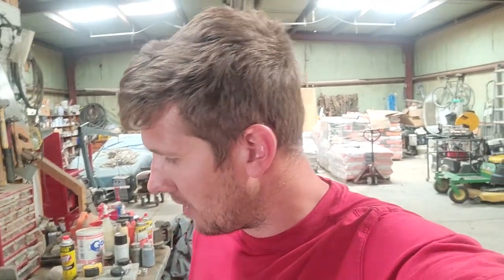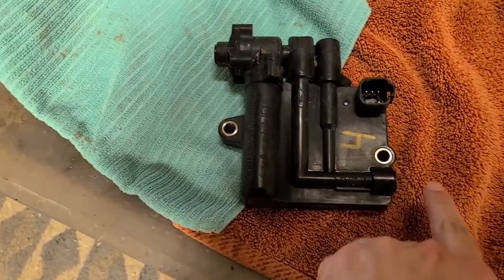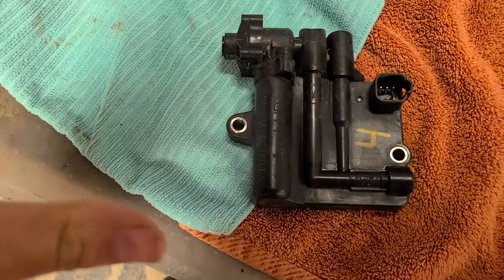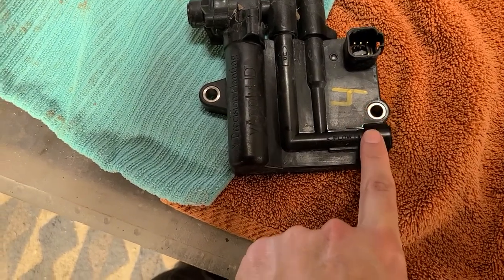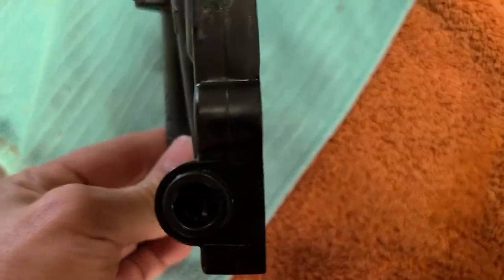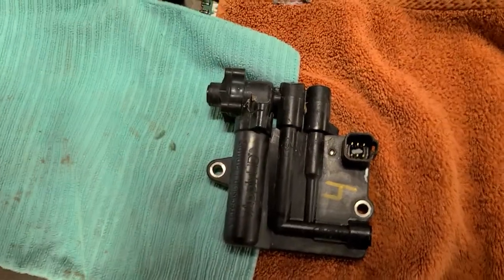Well, we broke down a little bit — not broke down exactly. I was getting low flow in one of my sections on my fertilizer system. I went to go try to clean it, reinstall it, put it back on — that did not work. It might be clogged or something, so I'm taking it apart here. This is the v-apply module they call it. Basically your flow comes in here, goes up, reader here. I'm hoping I can take this thing out — there's an impeller in there. That's hopefully what's clogged, because the water has not been able to fix the issue.